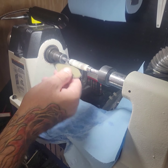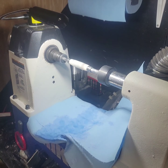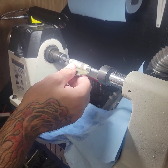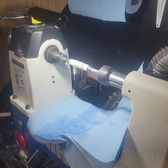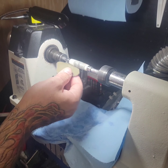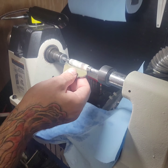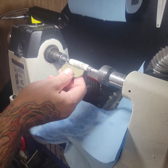We're not pressing. Not pressing down. You just let the pad do the work. Now once you get to about this point, you can really feel the blank through the pad — it gives a lot of feedback. I'm going to go ahead and finish these and then I'll bring you guys back. Okay, we're back. I sanded it to the final 12,000 grit. Now I'm going to do what I do — some people may not agree with this, but I don't care. This is how I do it.